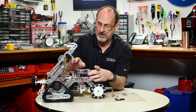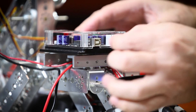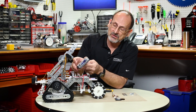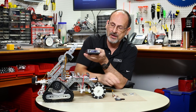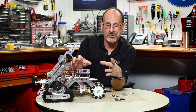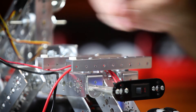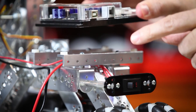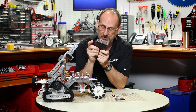If I hold my Prism up, you can see I've got a good mounting position all the way around — access to my wires in front, access to my switch, and easy access to my USB port for programming. There's one more thing to consider: I have a flat bottom on the Prism but I've created some bumps with these button head cap screws. If I snugged the Prism board down, I could cause a crack in the case. I'll alleviate that by using little nylon spacers to give some room between the angle pieces and the Prism board.